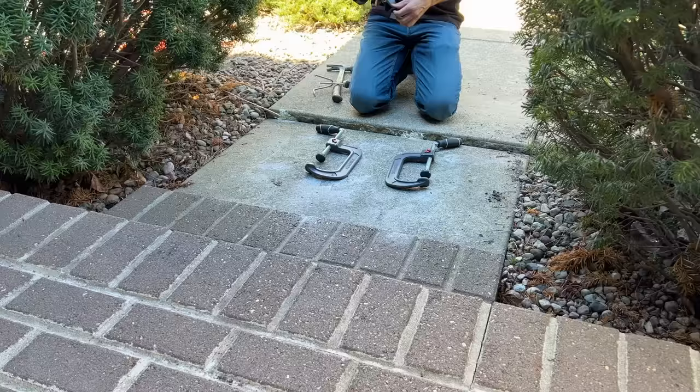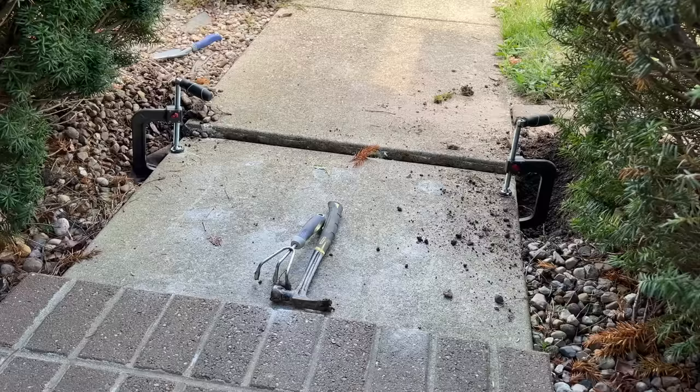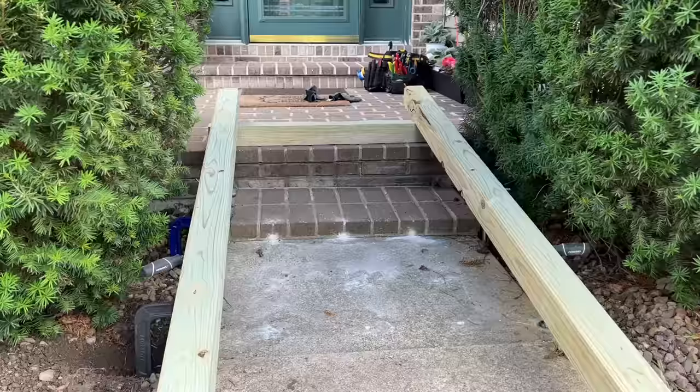I'm going to use four C clamps and grab on to the side of the sidewalk, so I just need to clear out a little bit of the gravel and dirt to get that C clamp up underneath — two locations towards the actual focus of the lift point and then two locations closer to the actual brick patio. Then I'm going to mark on the brick; I don't expect much movement there but I do want a reference point. Four by four posts, each being eight foot, is really what's going to do the heavy lifting.